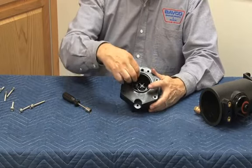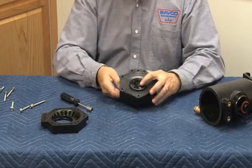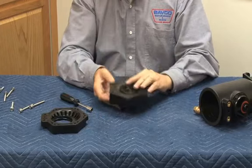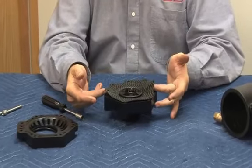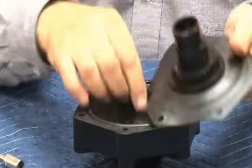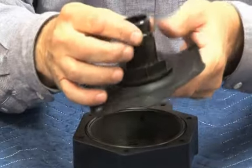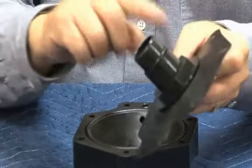Again, O-ring sitting in here. The relief valve body comes off here, and this leaves us with our relief valve cover and with our relief valve stem. Now you see the diaphragm grabbing that, pulling the stem up from here. Relief valve stem comes out in one piece. On the end there will be a stem O-ring. This is called a plunger.